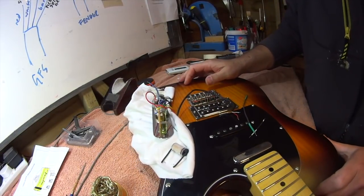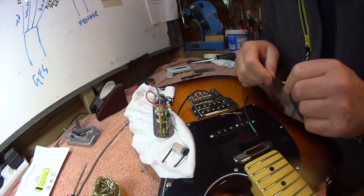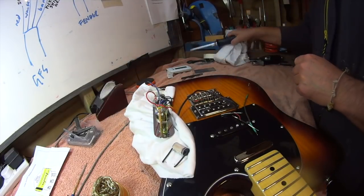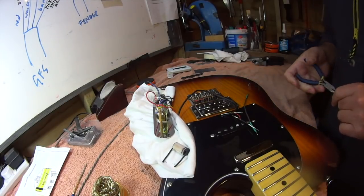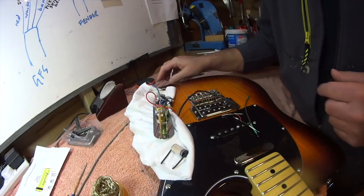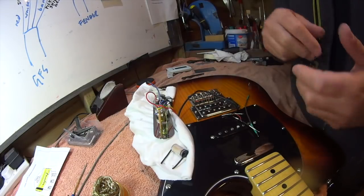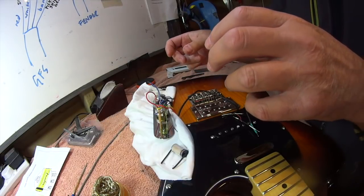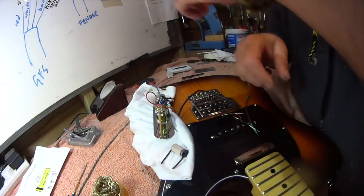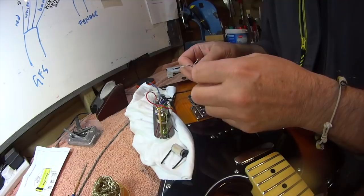Good day, welcome back. Here we are with the Fender Telecaster Modern Player, and I'm just about to realign some wires to get this thing back together in its reversed state. So we're getting the control plate reversed, so we've gone to volume, tone, switch. We've switched these two upside down so they'll be working in the right directions, because we're going to flip the whole plate back to front, which is effectively upside down. I've also got to connect up these things here.